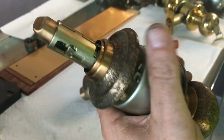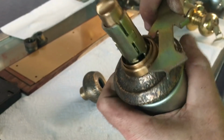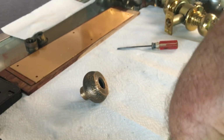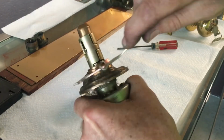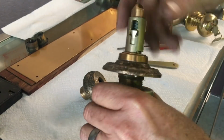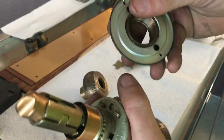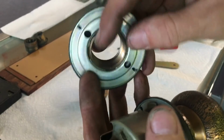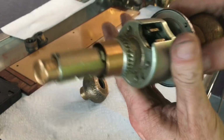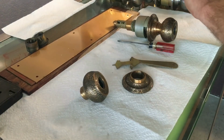and that is tightening it. So to loosen it, you would basically flip it around the other way and put your leg carefully up against it and start rotating it counterclockwise until you're able to unscrew it from the door. And you can see, even though there's 2 holes there, looks like screws will go through, no screws go through. And at that point, you are pretty much done. You just slip it off the door like anything else.